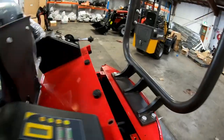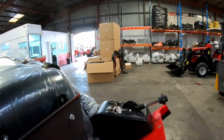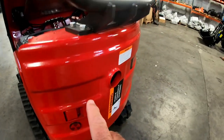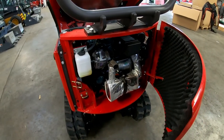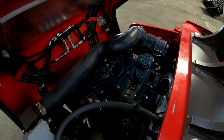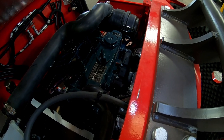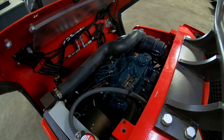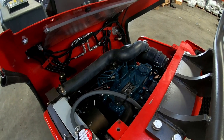You can basically pull that forward, and then this door on the back panel actually comes out and swings open. That's worth the price of admission by itself — all that access in there. This engine is the Kubota D902, 16 horsepower. It's a little bit more powerful than previously in the 1.2s — they had the 14 horsepower Yanmars initially and then the 14 horsepower Kubotas.